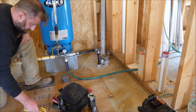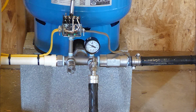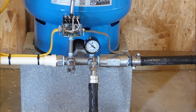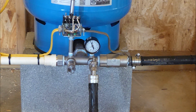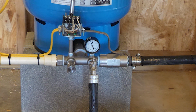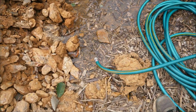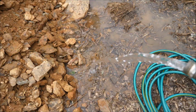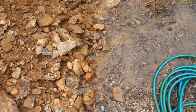What's this pressure switch set to? 40-60. I'm surprised you guys with a new house didn't go for the constant pressure system. I don't even know what that is. Basically, you live on well water like you live on city water. There it is. Constant pressure of 70 psi. Yeah, eventually it just clears itself up. Awesome. I don't have it all open yet. We got water. I'm stoked.